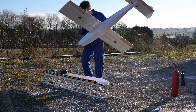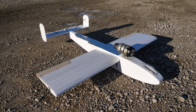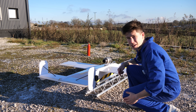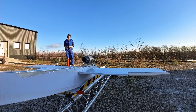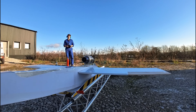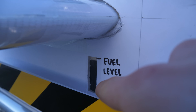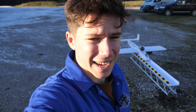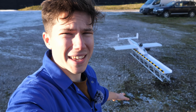With the electronics, fuel pump, radio, GPS, and everything else all working perfectly, we could now fire up the engine for its first static test run outside — mainly to see if anything caught fire. In the spirit of avoiding fire, the final preparation had been to add aluminium foil tape around the fuselage to reflect the 700-degree heat from the exhaust tube. The test run was terrifying — the whole thing was shaking around. This is going to be a scary thing to fly. We used quite a lot of fuel just sitting there, so I predicted only about two minutes of actual flight time. Tomorrow's the big day. I've never flown a jet before, never flown anything as sketchy as this, and that's saying something for this channel.